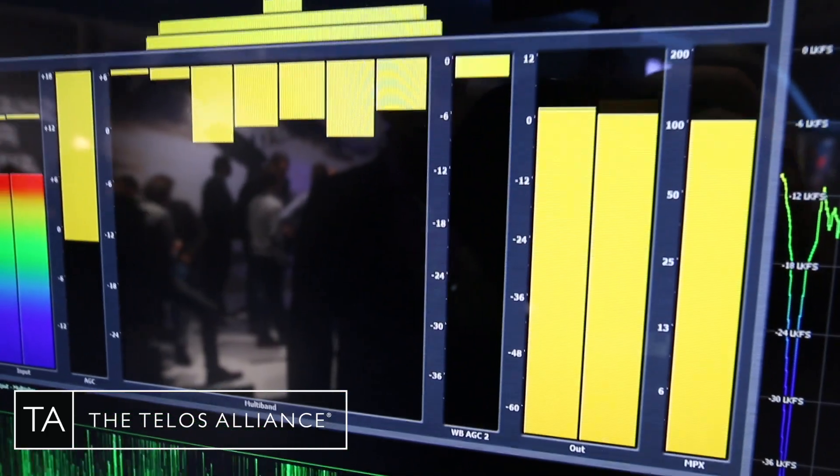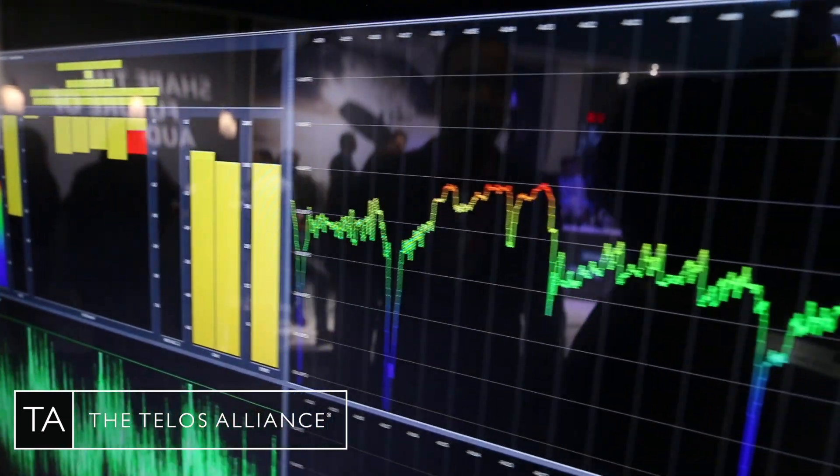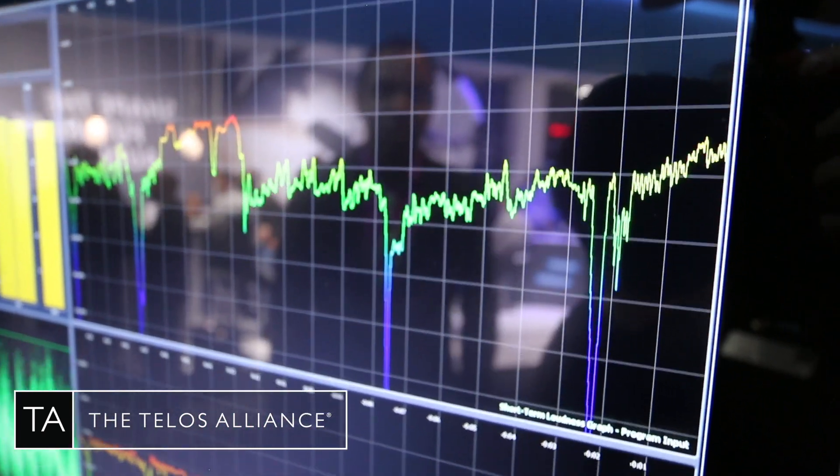Yeah, so now the total on-air delay is something like 600 milliseconds, instead of over one second. Which is still way, way too slow for headphones — but less is more, right? Most importantly, it sounds better, especially when pushed. It's the same type of sound I was going for, but he got even closer than I did. Hans' clipper is kind of like this TARDIS effect from Doctor Who — you get more into it than it's big enough to hold. In other words, more audio with less processing. The 9 always did this with its famous 140% audio in 100% modulation, but it's even closer now and pushes the envelope a little bit further.